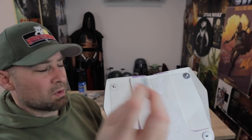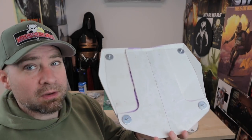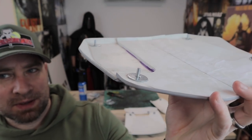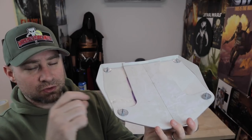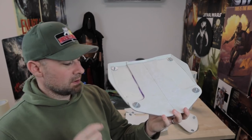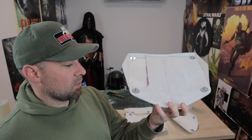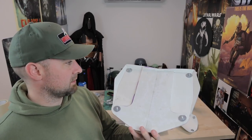We're going to use the washers as a support system. We're going to glue that washer down and you will have these mounts. Now these are extra long. That's going to be a pain for people that don't have the ability to grind these down. So if you can find shorter screws, you definitely want to find shorter screws, but I have the ability to grind these down. These are half inch, you might want to go 3/8, 5/16 long, not wide. You might be able to find some 8/32 screws, but a lot of the stuff I have here, I use 10/32, so that's the way I went.